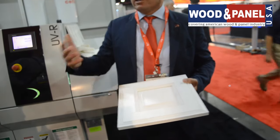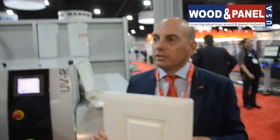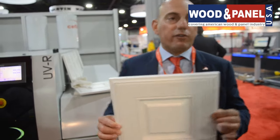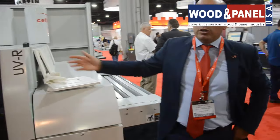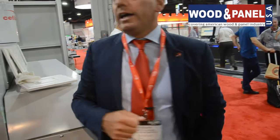The spray technology allows me to do flat panels as well as raised panels like this — a typical solid timber kitchen door that you can find in a normal North American kitchen. As I was telling you, the machine is equipped with the color change system, so eventually the customer wants to do stain, dry the stain, and then final top coating is achievable, and the operator doesn't have to worry about cleaning the circuits, pumps, and so forth — it's all done automatically by the machine. Different reservoirs are flushed automatically. We have a control panel that gives us the possibility to change it. There is a little bit of lacquer wasted, which is the one from the recirculation of the circuits to the guns, but really a minimal amount.